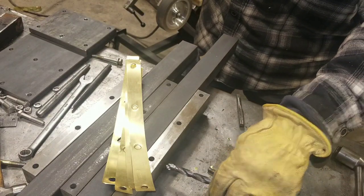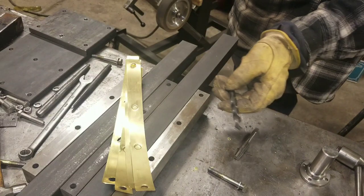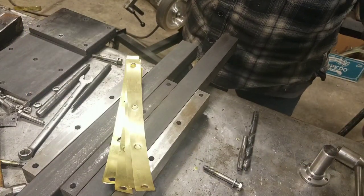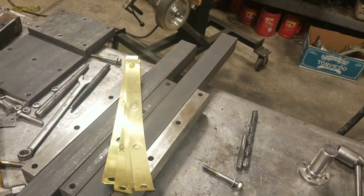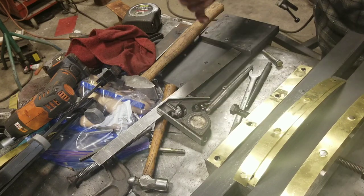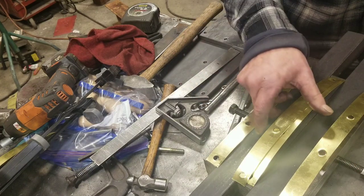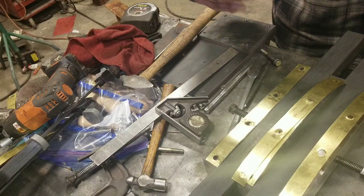Before putting this together I'm going to drill the sides of the side frames. We're going to go half-inch, 13 threads — using a 27/64 drill bit. This is for my tooling handle locking arms; they'll thread in on both sides. I've got those tapped out at half-13. These are locking studs — I put studs in with red Loctite; for now I'm just using bolts. I'm not going to show putting the top on, but it really wasn't that bad.